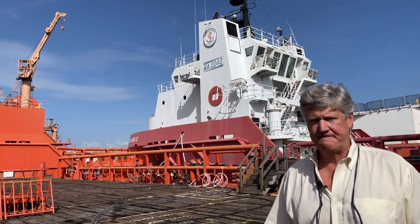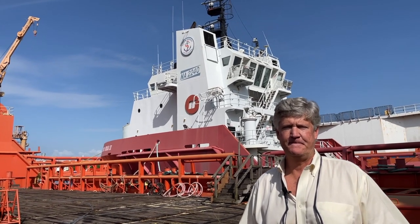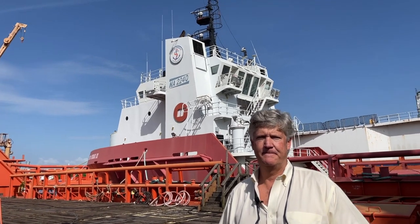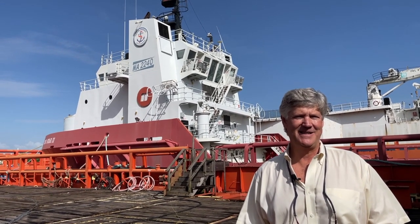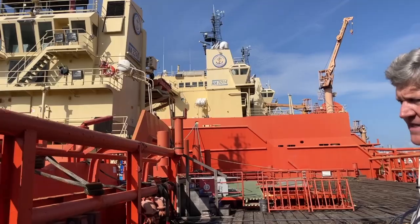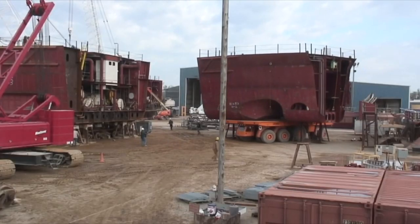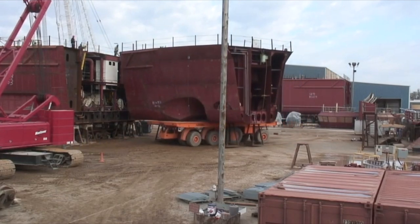And this is all high load bearing deck. This is high load bearing. So the additional structure that we will do for the conversion is going to sit right on here, and it doesn't need any more steel work. Right. And the additional weight of the additional structure won't approach the limits of the vessel by any means, not even close. The rest of the hull structure on this boat was originally protected before paint, primed with zinc chromate. So that's something that most boat yards don't do.